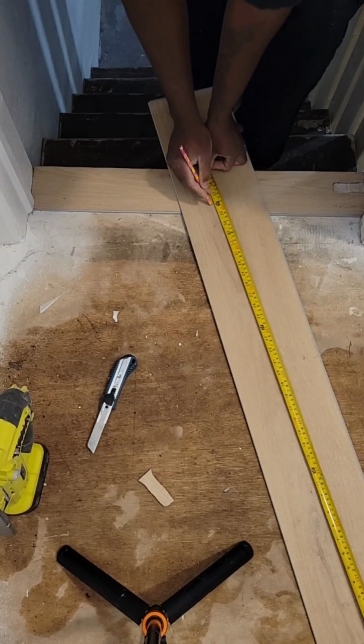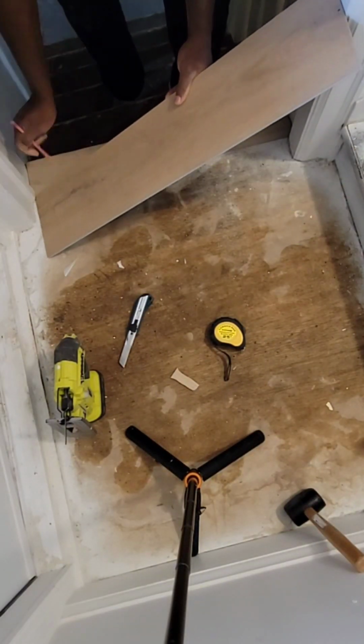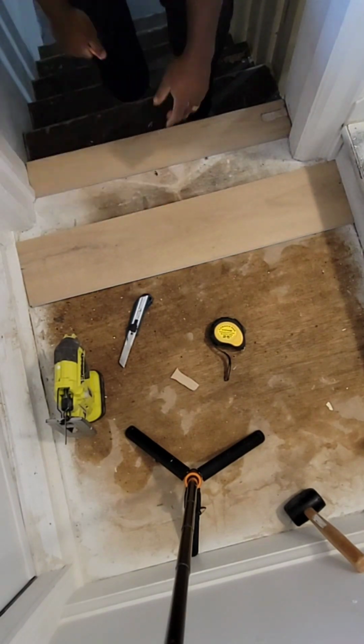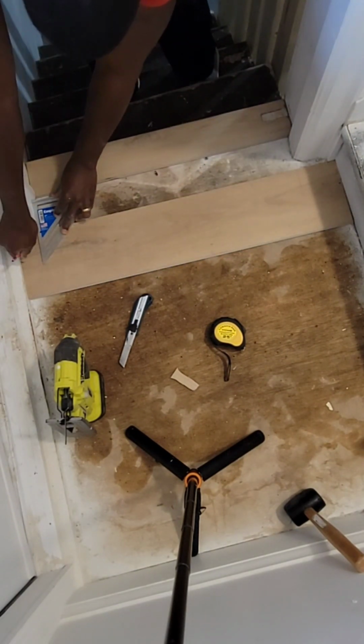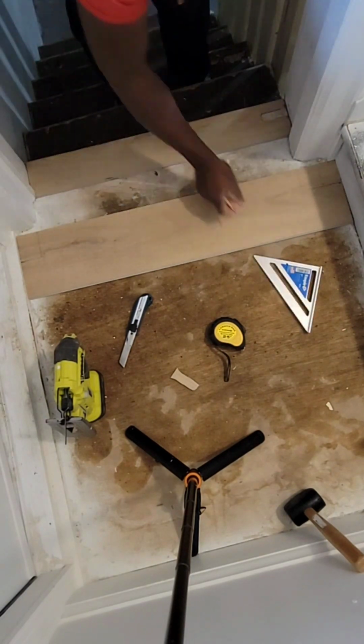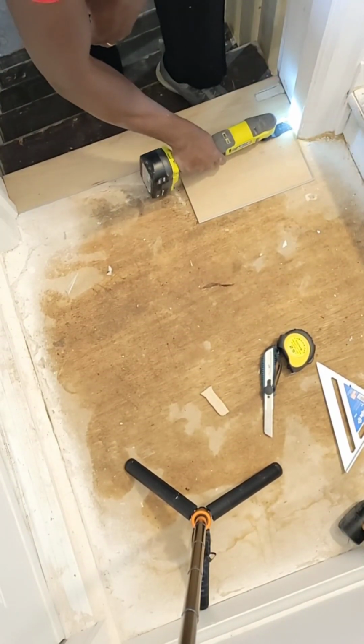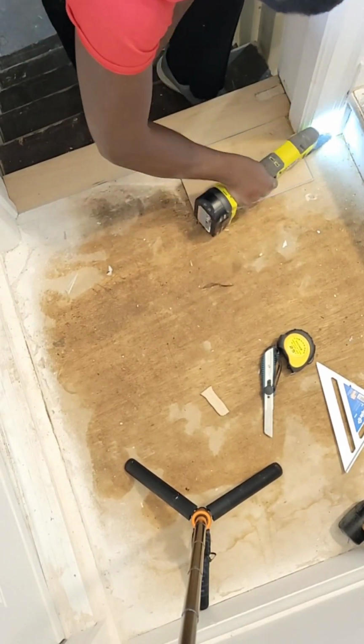Often we're going up and down, we're going outside the property to do cutting. You can see them going there. And lots of finicky things here and there. If we'd already installed the nosings on those bottom steps there, then we would be walking up and down on them and possibly cutting them, moving them out of place. So that is why we do this dry fitting.